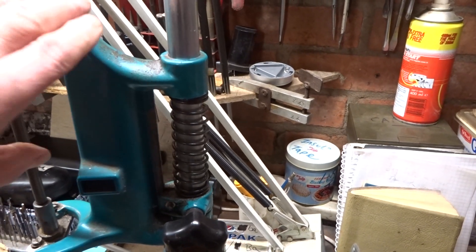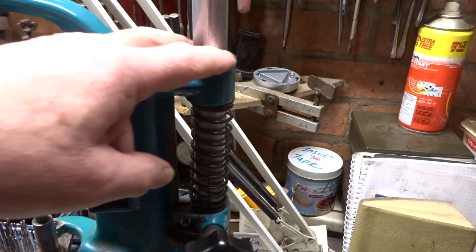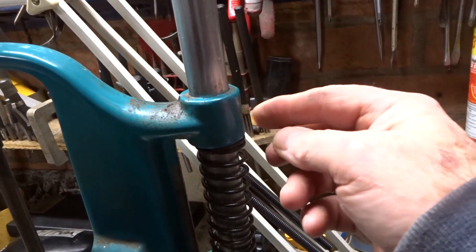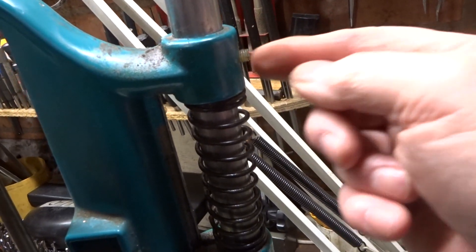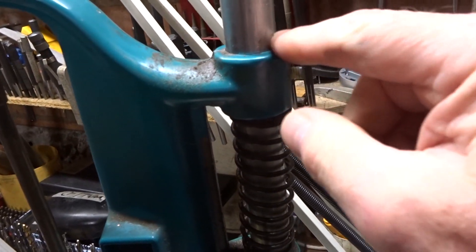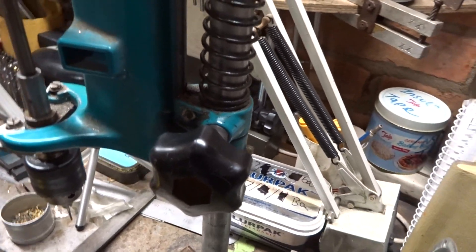These things were never accurately made and there was a lot of slop at these points here. What I thought I would do — and what has always been satisfactory — is I just drilled and tapped the back and inserted a piece of plastic, screwing it up a bit to create an adjustment at the back of this support to remove any play at this point and also down the bottom. It just took the play out of the arrangement, and over 30 to 40 years it's proved extremely satisfactory.